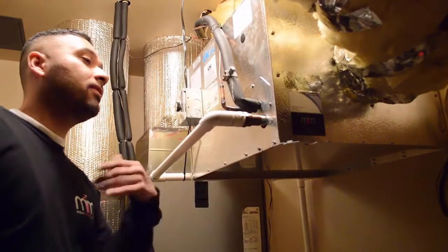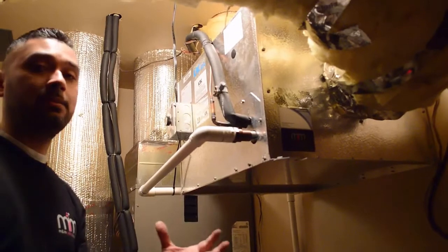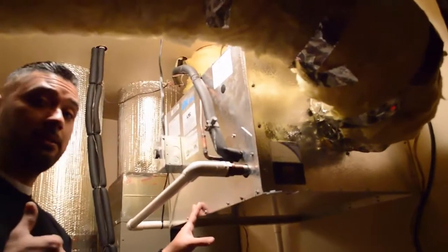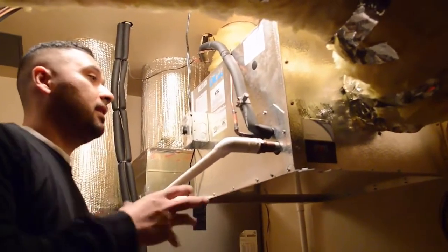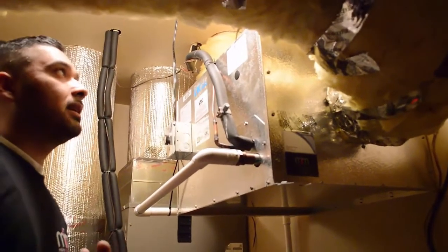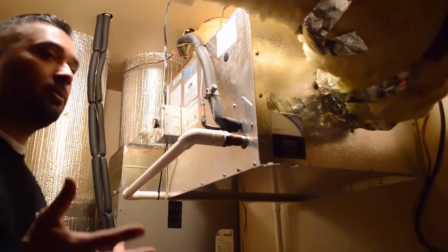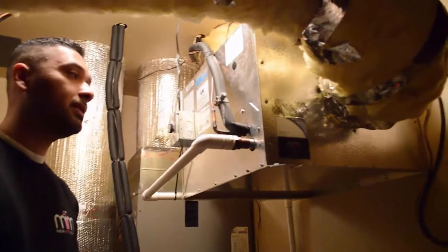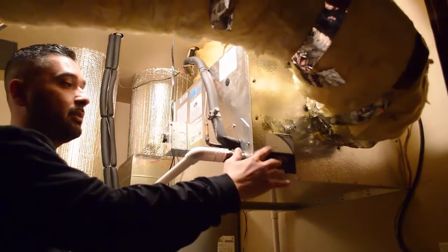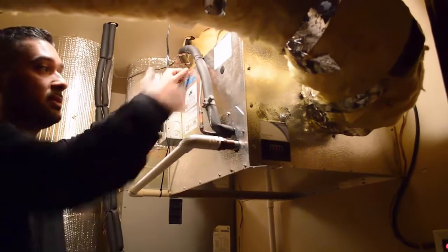Basically what I was explaining is that here I saw the UV dye substance that I injected into the system out there by the condensing unit, the outside unit. I noticed that when I was here, and again, it's not very common to see a leak like that on a unit that's 2 to 3 years old. So in this case, what I'm going to have to do is open up the unit. This is the site where I'm going to open it up right now to determine where that leak is, because I don't see it out here.